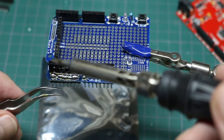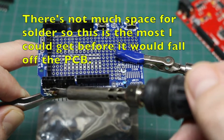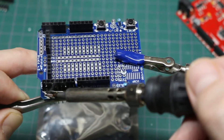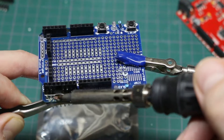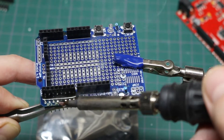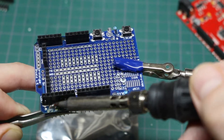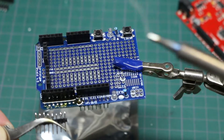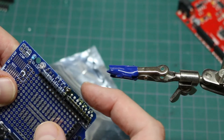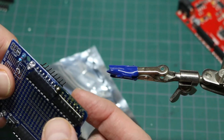So I'd either want to use a proper electric vacuum desoldering tip, or I'm just going to have to heat all these pins up together and let the connector fall out. I'm trying to bridge all the pins and now I can drag this ball of solder up and down the row of pins. Sometimes they drop out fast if the hole is much bigger than the pins, but these are a good tight fit so I need to pull as I heat all the pins. There it is - that's one way to do it.